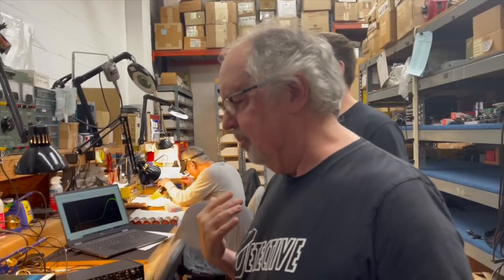So this is a staggering amount of top-end frequency response, but your ears don't really hear it, and your speaker doesn't really reproduce it, but it makes its presence known. Do dogs love it? Dogs go berserk over this. But what's really happening that you don't hear is that there's still this sensitivity to the guitar behavior, and it could cause the guitar signal to start feeding back with the amp.